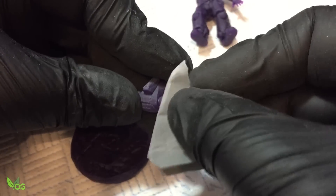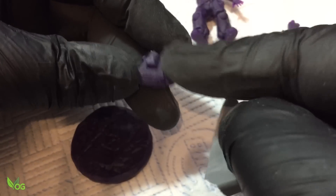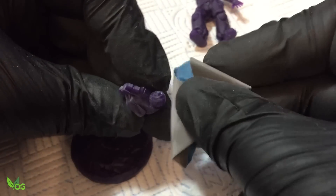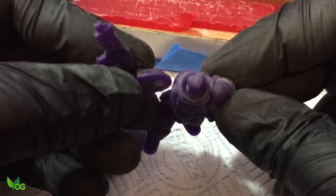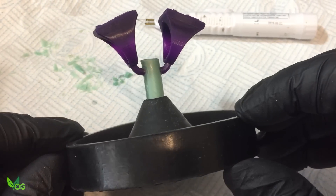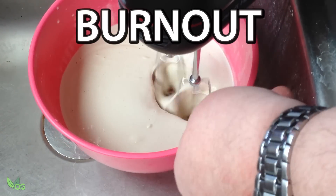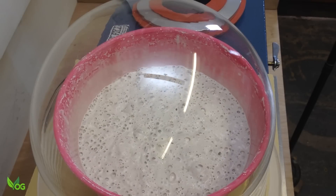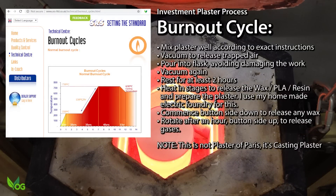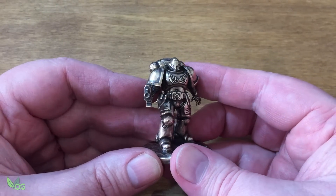The purple is okay to look at, but I like a nice grey — it's easier on the eye and allows me to see any imperfections that much easier. I did find sanding made the print powdery in appearance, but a quick rinse under the tap fixed this. Wax stuck well to the print, so spruing isn't an issue. Soraya Tech assured me any burnout used by most common plasters will work fine, and I have to say it has for me. I've genuinely done nothing different to normal and I've consistently found burnout to be clean, producing some castings that I've been thrilled with.